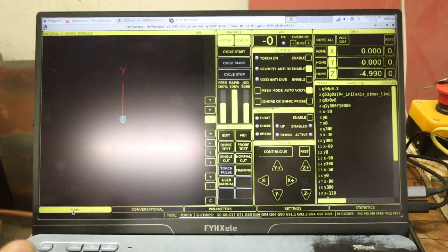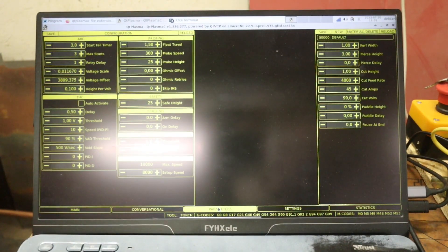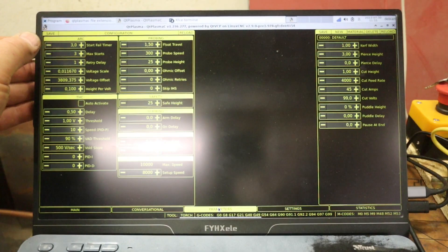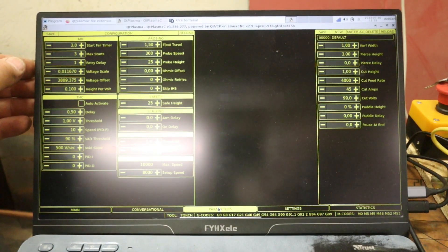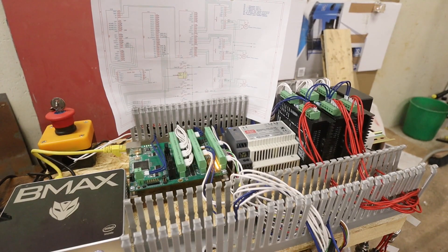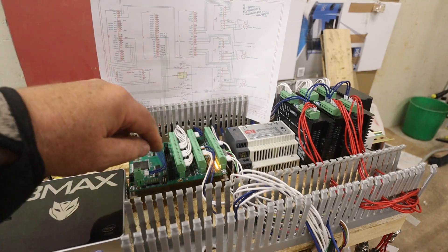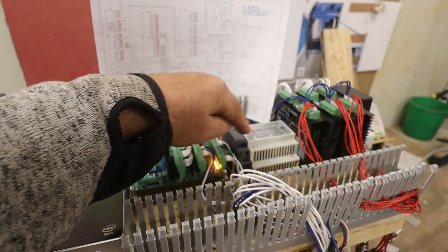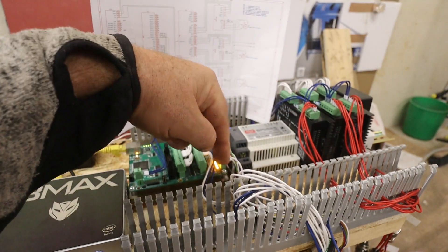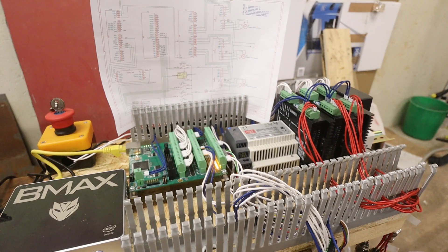You can adjust parameters on the fly. Here are some parameters - it looks like a lot, but this is for the start. You can start three times and wait one second between. There is a scale for the voltage and I will come to the meter. In principle, this is set up like a three-axis milling machine. There is a Mesa card because I run LinuxCNC, a 5-volt power supply, 24-volt power supply for the stepper motors and for the field logic, and stepper motor drivers for XYZ. There are some inputs and outputs, and there is one interesting thing.